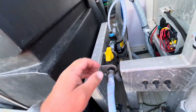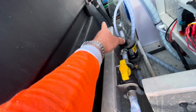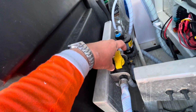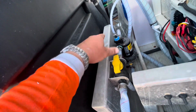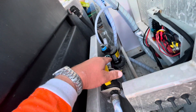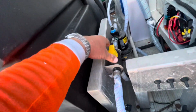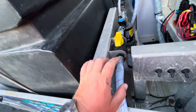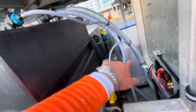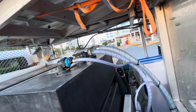up that way. The reason I've got a 3-way valve on this is connected straight up to my tank, and then I turn the 3-way valve to water for about 5 seconds, just to flush out that pump every time I fill up. So I flush it out, and then I'll turn it back to my line and pump air into the line. So I pump air all the way back up here to cause an airlock.